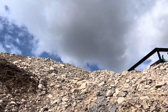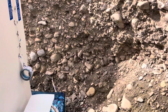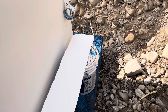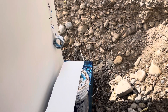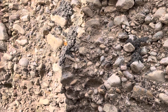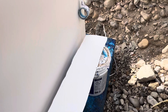The other problem is that some of these rocks are pretty large and that's what my backfill is — up there's my little mountain of backfill. In the next couple of days the excavator is going to be dumping it down into here. My concern was that if I didn't have something to protect the rubber membrane, those large rocks could pierce it or damage my ICF foam. However, I actually live in a high mountain desert valley — we get less than 20 inches of rain a year and there is zero clay, so I'm not worried about hydrostatic pressure. But I'm big into belt and suspenders, so I want to do everything I can to protect that blue rubber membrane.